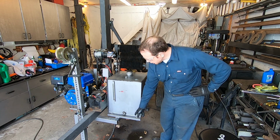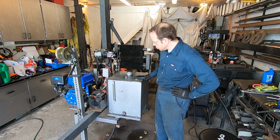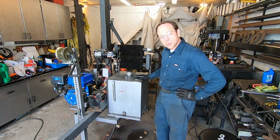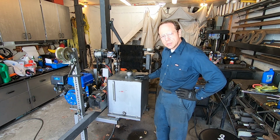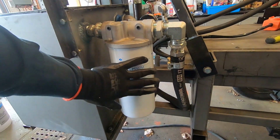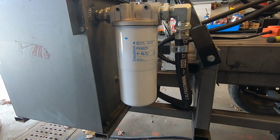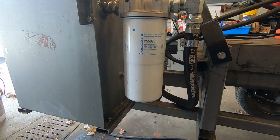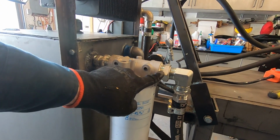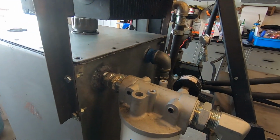So I had to empty the oil into those two bins to be able to do some work also with the tank. But first, what solved the problem mainly is the filter. Now that's a filter. So you gotta get a good clue. It's 4.5 by almost 12 inches high. It's 1 inch and a quarter NPT, so it goes down to 1 inch going back into the tank.